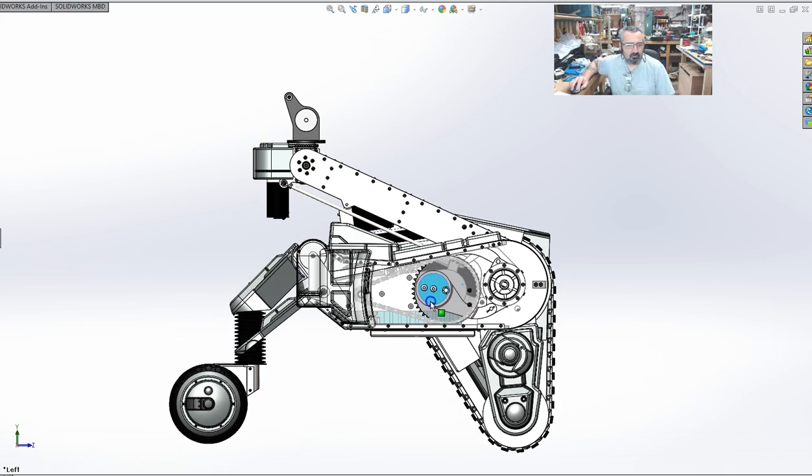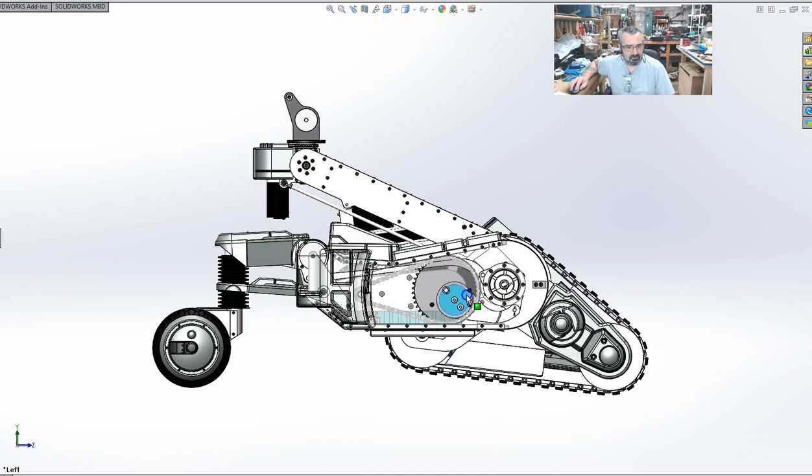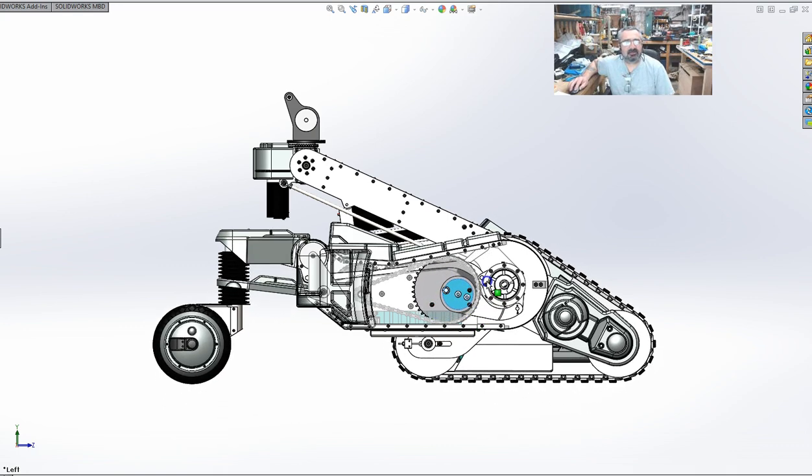Now, a change. The original plan was that this could go in a forward or backwards orientation, and it wouldn't matter. What I realized is that I realistically could not do that with a feedback system, because it's an eccentric drive. It's a reciprocal system, so it's not a pure linear relationship.